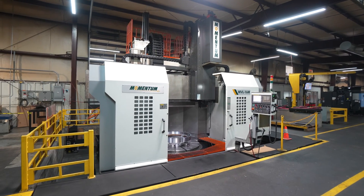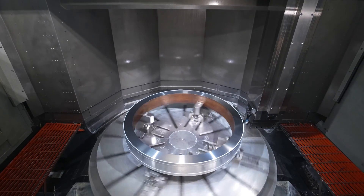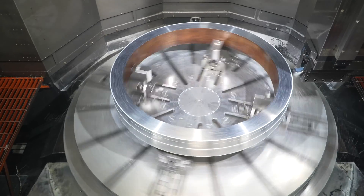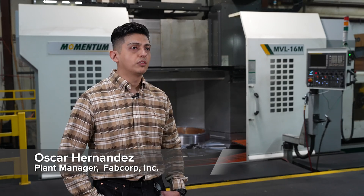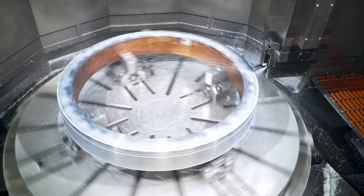With the 63-inch chuck, 78-inch max turning length, and 63-inch max turning height, it gives us the ability of full mill-turner work. I've turned up to three-eighths — radial cuts from 30 thou to three-eighths. These tough materials, no complaints; the machine pushes it. With the 75 horsepower it offers, it's more than enough for what we do.